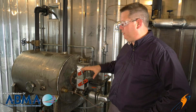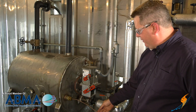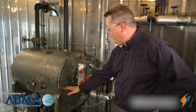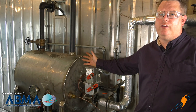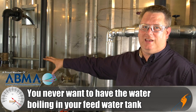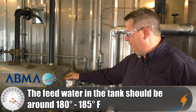I've got two things to show you here. One is our thermal well. This thermal well houses a capillary tube, and that capillary tube puts more pressure on the line to our control valve as the temperature goes up, so we can make adjustments at the control valve to allow the capillary to properly control it. This particular capillary has a temperature range of 125 to 215 degrees. Since 215 degrees would be too hot to even pump the water, we're generally going to shoot for a temperature of between 180 and 185 on a vented preheat tank.